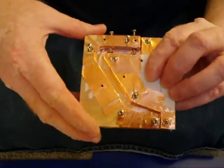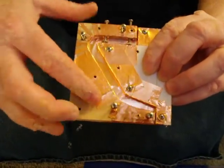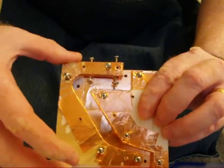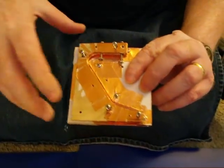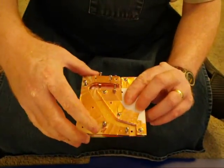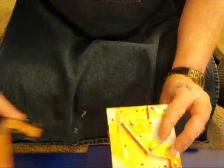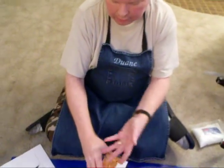While squishing it in, this part of the mold isn't secured, but I secure it during the actual landing gear making. Once it's filled I spray canned air on it to help it harden up quickly. Then I unscrew the bolts, which leaves the nuts embedded with a nice hole through the landing gear, pull it off the mold, and I end up with the finished landing gear. It just works so well — I was really pleased.